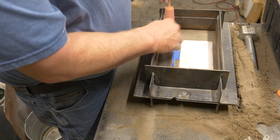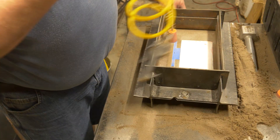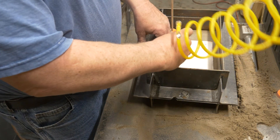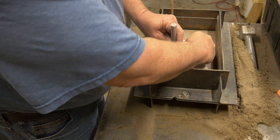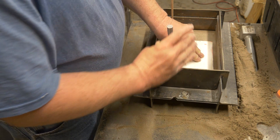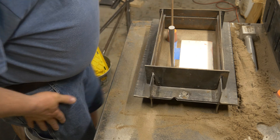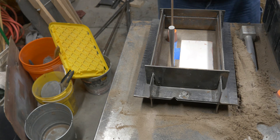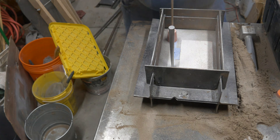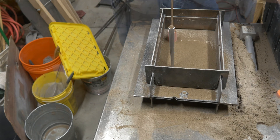Get that sand out of that hole first, then put the spin trap down. I've got to blow this hole out for my sprue as well. I always mold a hole in my runner so I can just place the sprue down inside, press it in, and it holds in place really nicely. That way alignment is always guaranteed to be right. The gate comes right off the runner — it's up on the top edge so the metal will run across the bottom of the runner first, raise, and then come in across the gate into the part.